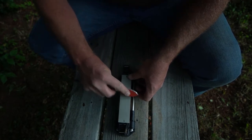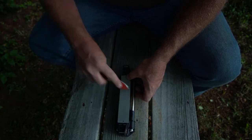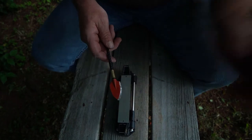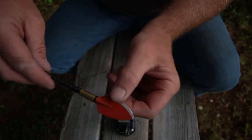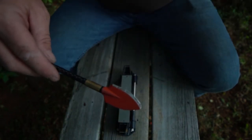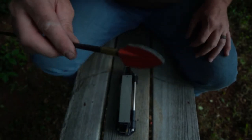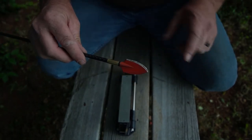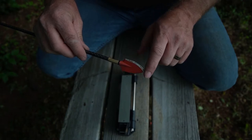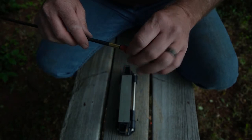As Adam and I were going, we could turn this head as we go. And if you have that Sharpie — or in this case the rust on the edge — you can see where it's hitting on your broadhead. You can see I'm just barely touching the edge but I've already pulled some of that rust off by following that bevel. This rough stone will take off a lot at first. You don't have to worry too much about doing both sides evenly, because if you keep that edge painted it will show you how much metal you've taken off and keep you pretty well balanced.